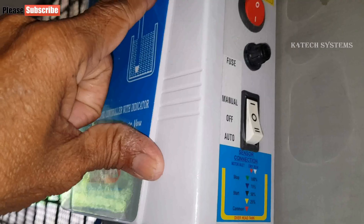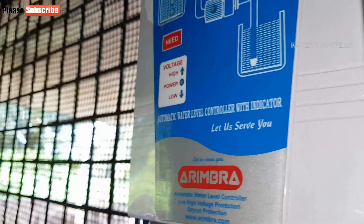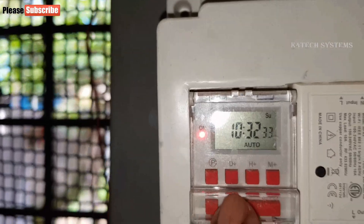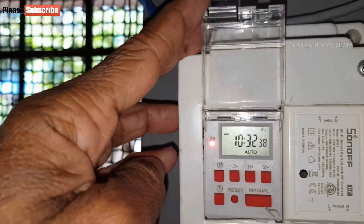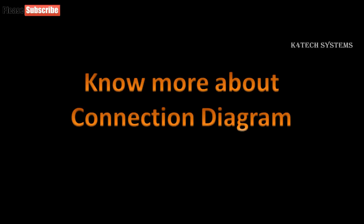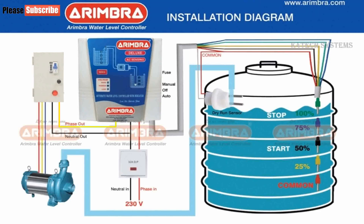In my case, since the motor is connected to an inverter for using solar power, the motor is not allowed to run automatically. Power to the water level controller goes through a timer switch which keeps it on only during sun time. Regarding wiring: there are 3 wires in the power cable — load in and load out with common neutral wires. Sensor cable wires from the controller need to connect with the same colored sensor wires from the water tank. If you don't have a starter switch, you can connect the wires directly to the motor.